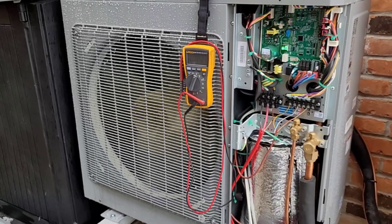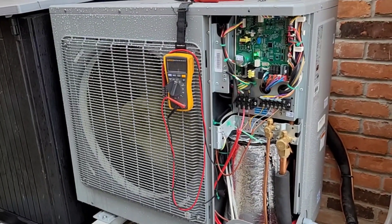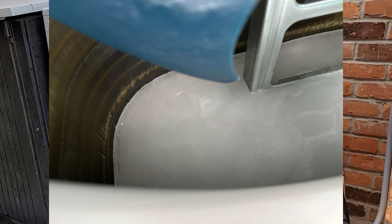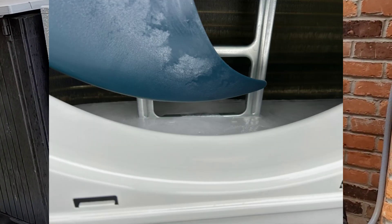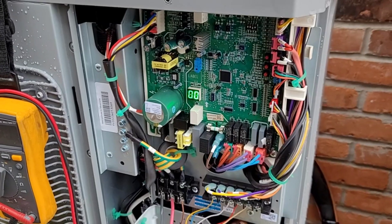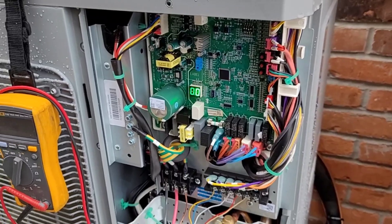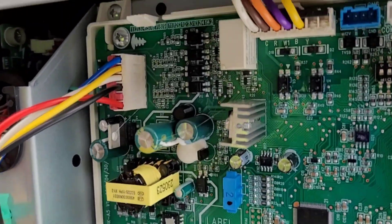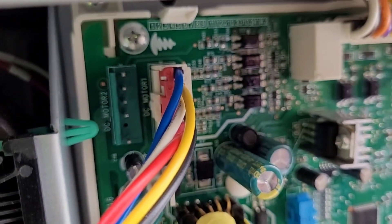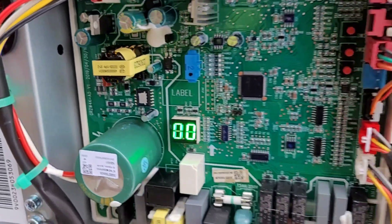If you have an EG4, take a look at your drain pan and make sure you don't have ice buildup. My little one-ton has been doing good, but my father-in-law in New York State has a pretty good amount of ice buildup on his heat pump. I've been looking at a couple of options to add a pan heater to the EG4 heat pumps — it is possible. We'd need two different ones, one for the one-ton and one for the two-ton, because they are different voltages.